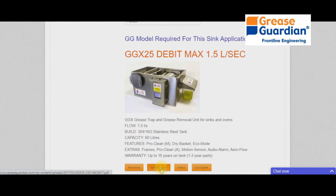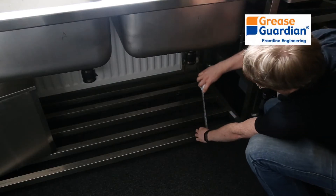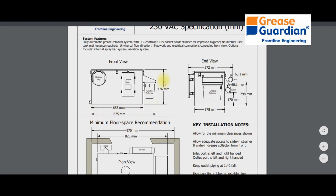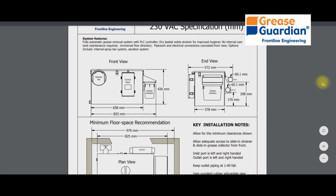You can now click the specification cut sheet to check the clearances and dimensions of the tank. You should ensure that there is space available under the sink, and always refer back to the specification sheet. Be sure to check pipe connections and fall, paying particular attention to invert levels.